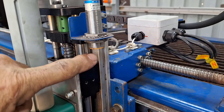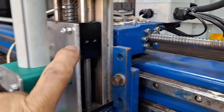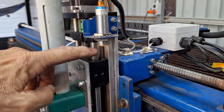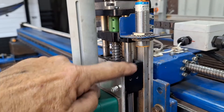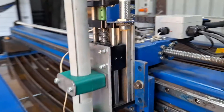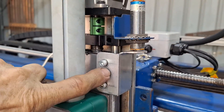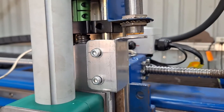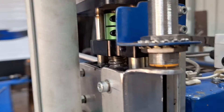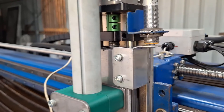When this torch travels up, this is its upper limit — I've just got to make a little bracket using these two bolts here with a small tab on it so it lines up with the proximity switch. Here is the striker plate for the Z-axis upper limit: it's just a piece of 30 by 30 angle with the end bent back, and I've set the gap at about 3mm. I'll test that very shortly — that's one more job ticked off the list.